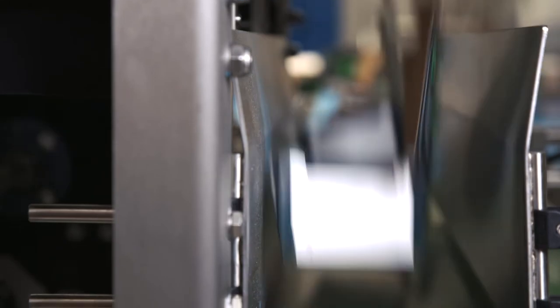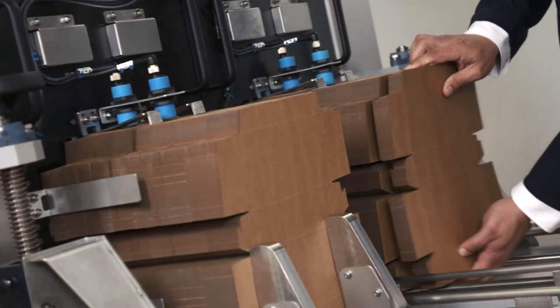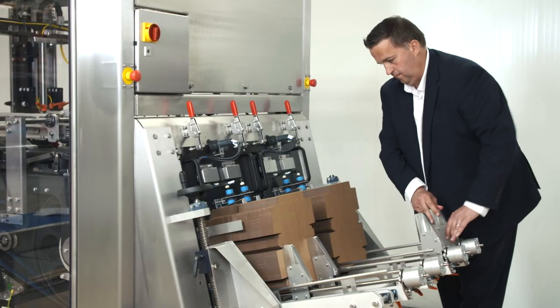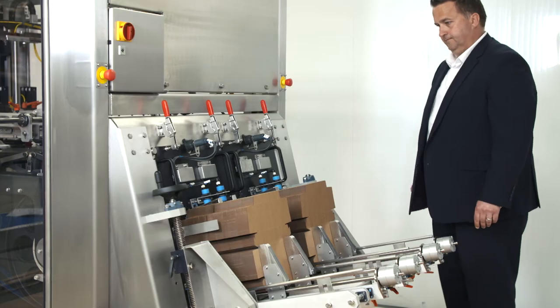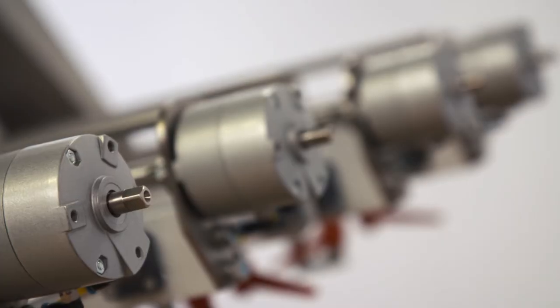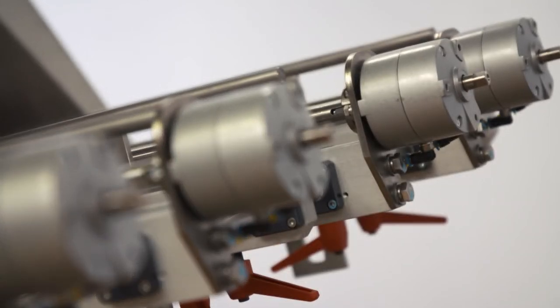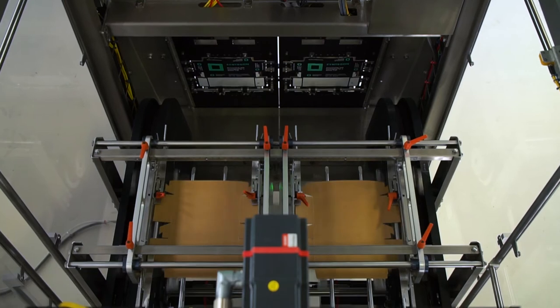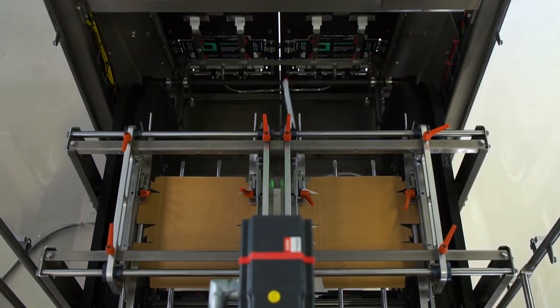You asked for ergonomics. Even with my bad back, I can load the hopper — no platform needed here. This hopper allows operators to safely load carton blanks without any manual handling or ergonomic risks. The hopper drives cartons through pneumatic rotary cylinders to ensure the right amount of pressure at the gate ready for carton pluck. This eliminates feeding problems and carton wastage.